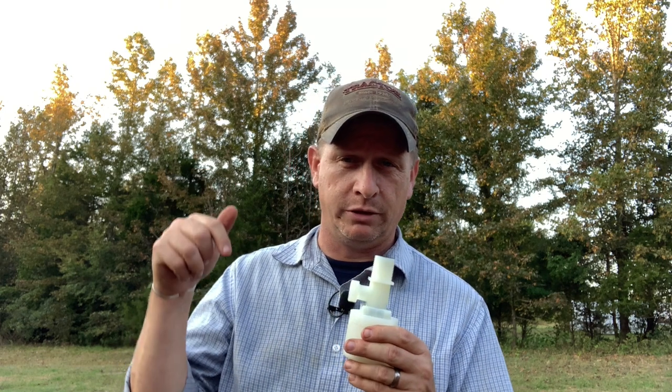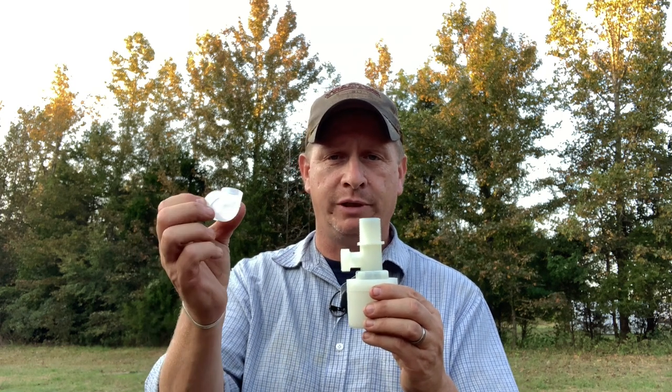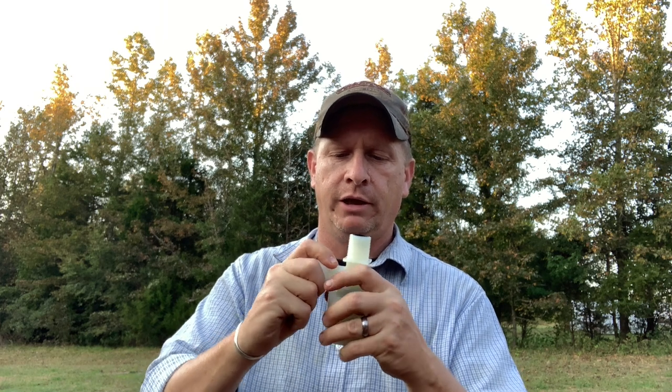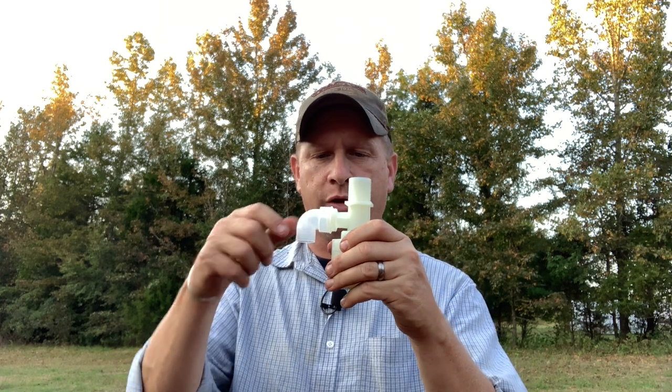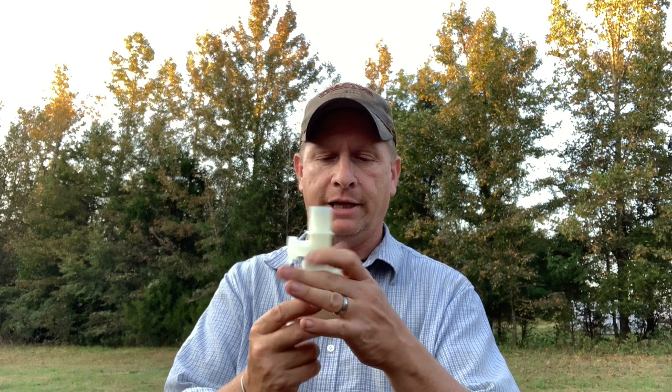When the water reaches a certain level on the float, it shuts the valve off and stops the water from flowing. We took the three-quarter inch PVC down through the top of the cap on the IBC tote, used a slip connector with a threaded end, wrapped it with Teflon tape, and screwed it on. These float valves we found on Amazon — I'll post a link in the description — two of them for $15. This one has a side outlet with a small plastic diverter piece; I just took it off and let the water come out the side. We'll keep experimenting since at the school they mentioned pigs sometimes mess with them, but two days in it's working fine.